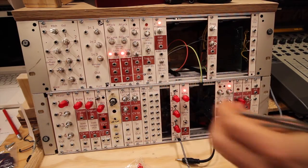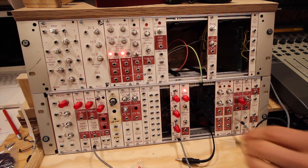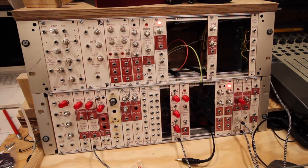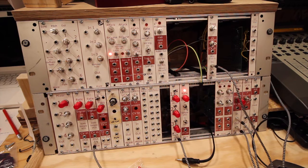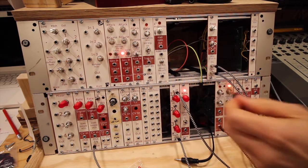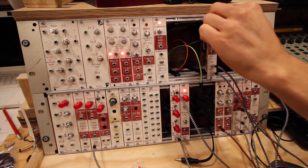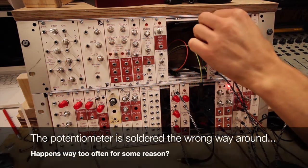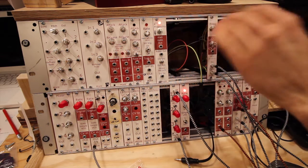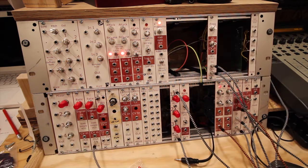Let's put it in the rack. We'll take the VCO into a VCA, the VCA out into the voltage-controlled filter, then out from that into the mixer, and control the VCA with the dual VCLFO. We can see we can remove the utmost edges of the square waveform. Now let's look at the difference between the 1N4148 diodes and the red LEDs, and bring out the scope for this.